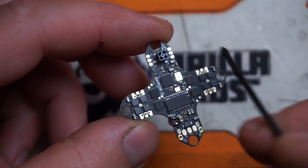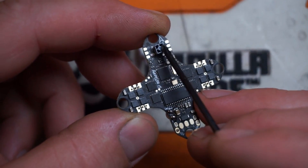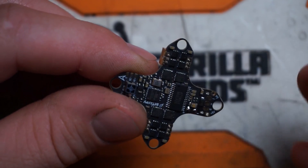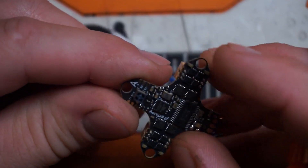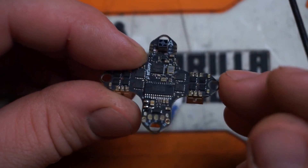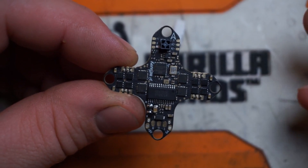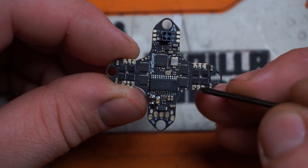There's no VTX built into this, but it does have the ExpressLRS 2.4 receiver. As you can see, it's using the SMD antenna. In my experience, this gets good range, but not as good as having a traditional T antenna. Still pretty good though, and if you really wanted a UFL connector and have the skills, you can desolder this and solder on a UFL — I've done it, it's not easy but it can be done. If you're doing high KV or high amp draw motors, you're going to want to do direct soldering to these pads. Personally, I would desolder these connectors because all the weight counts, especially running 1S.